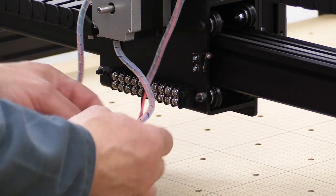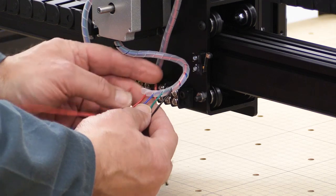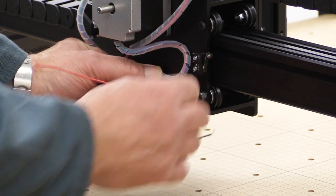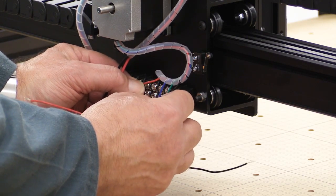When you're trying to break out a number of wires from this spiral wrap, sometimes it can be quite a neat job to have them coming out individually so that when they're placed above the terminal block, they're going to the right area and that will look quite tidy.